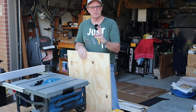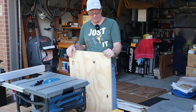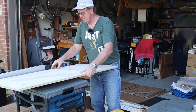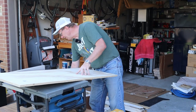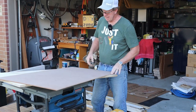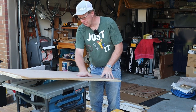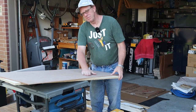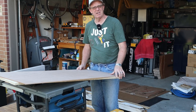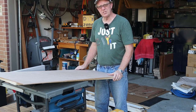To make the table part of this sled, I'm using two different products. One is three quarter inch plywood from Home Depot — already cut two by four foot, sanded one side — and I'll rip this down to the 16 inches we measured. I also got some hardboard, which they label MDF. I'll rip it down the same way and then glue the two together. This surface is slick and I'm going to make it even slicker by waxing it. You could use melamine — they just didn't have any at the store. So I'll use contact cement to put them together and this will do just fine.